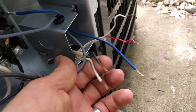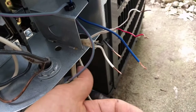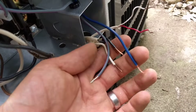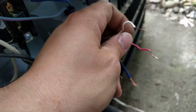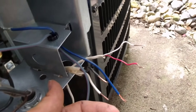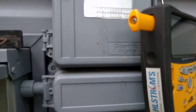Now these two wires right here are the ones that are actually coming from the inside from the furnace, which would go to the Y terminal and the C terminal on the furnace. Normally those would just hook directly to these two wires coming from the air conditioner. There's a third thing right here that is a utility company control wiring that they can shut off this air conditioner if there's a really high load on the electrical grid, and that's what this box over here is for.